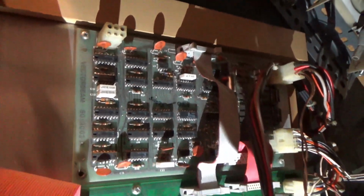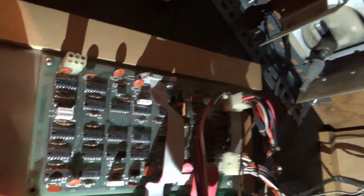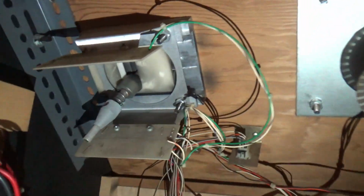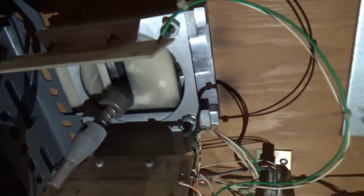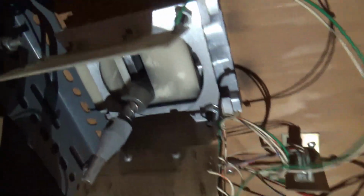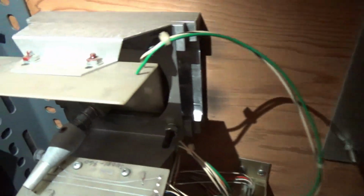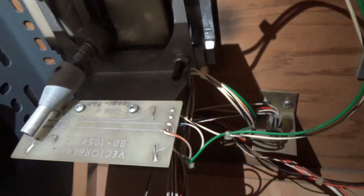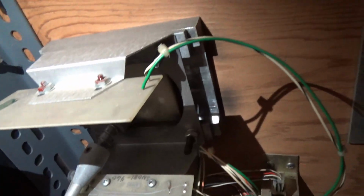And here we have the soundboard, sound controls. And over here, I have not seen one of these in real life until now. Well, I'm told there's a magnet on the end of this, and it selects limit switches. Magnetic reed switches, I should say. And actually, I can see them now. Here are little glass tubes. When there's a magnet that moves on the stick, it activates these switches. And here you have a plain old quadrature input. And I don't know if that Atari button's original, that cone button, or not. I'll have to look into it.